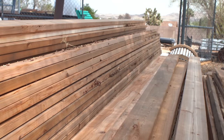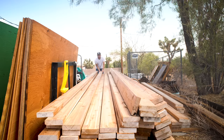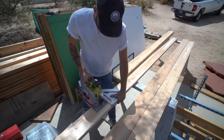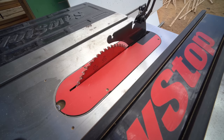The top boards have a little bit of weathering, so we'll put those to the side and save them to cover up later. But check out how nice this grain is underneath. The client liked the idea of using cedar because these are going to be outdoor tables, and I was able to give a good price on the materials. The leg hardware for the benches have an inside opening of 15 inches wide, and that's why I need three more of these 20-foot 2x6s so I can cut six 5-inch wide pieces for one bench on each side.